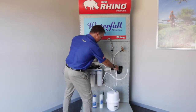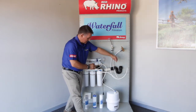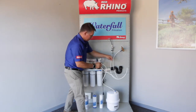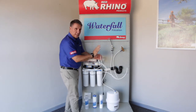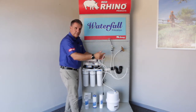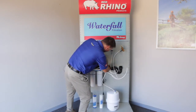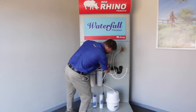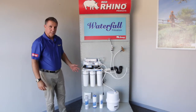We've connected our tank. In your box you've also got a little connector for your outlet, and that goes onto your pipe — drill a hole through your pipe. There is a little flange that goes with it, a little black one-sided tape — stick it on, because this is just an outlet for some of your wastewater. Connect it down at the bottom here where it says 'to waste', connect that in there, and that'll be sorted.